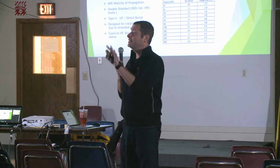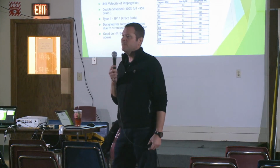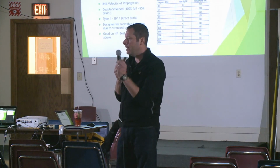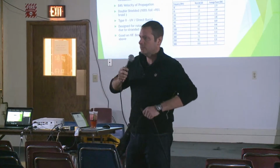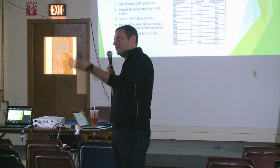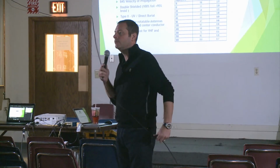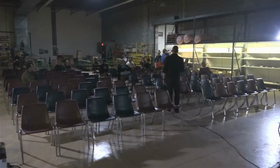And like I said, I say odds are. Right. That's why we go typically with the stranded center conductor, but if it's not too tight of an angle, then yeah, you can get away with that. If it's being bent consistently, odds are it's going to break down a little bit quicker than a stranded center conductor. Gotcha. I tried to make it as small as possible, so it's not like a big loop. It's a very tight loop, very slight curve. And it still makes it around 360 without any problem.